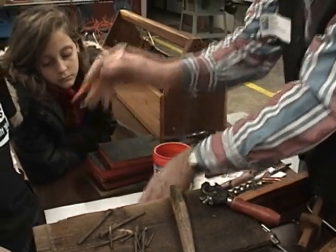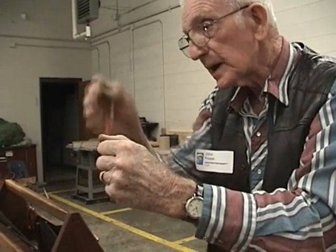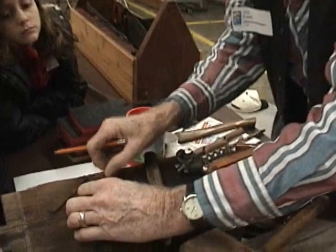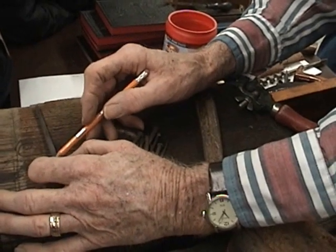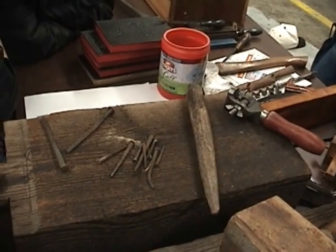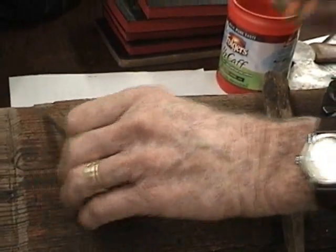Now, as that machine sheared off one piece of steel, it would articulate just a little bit the other way to shear off the next one. So that's why you end up with a taper, see how that's tapered? It's about 1/8 there and over 1/4 here. So as that machine sheared, it would shift a little bit, shear again, and go back, shear again.